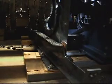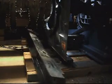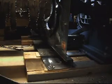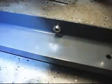Alright, now we've got it separated from the sides, from the actual subway, the ball return. We'll just bring it out. Sure, it's kind of hard to see. There, you can see it. See that black line in the image? That's an actual crack, a hairline crack going down that frame.